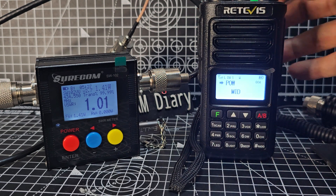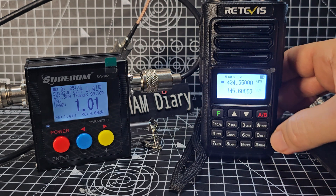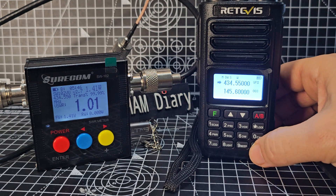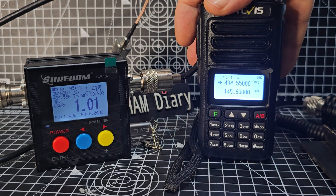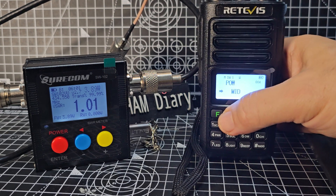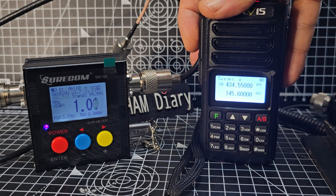Medium power. Probably WR. That was WR on the B band, but we're on the A band here. To go between A and B, you just press this — press the red button. And to go between VFO and memory, you just briefly press the hash. Memory, VFO. So let's just quickly key on 70 centimetres — we're on medium power, just under 4 watts. Then we'll go menu 4, F again, then up to high power, enter, escape with the PTT, and then we'll go on 70 centimetres — nearly 7 watts.